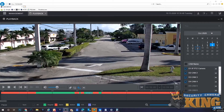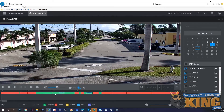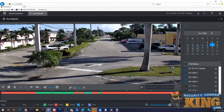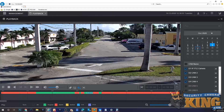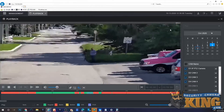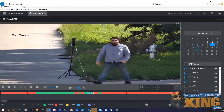Before we show you the footage, just take a look at the bottom of the screen and notice that there are two types of footage. The green is for 24/7 recording, and the red is for alarm input footage from the camera being triggered by the infrared beams. We've got these beams placed pretty far apart. You can vaguely see me at the far end just standing to the left of the sending beam, and the receiver is past the camera so it's not even in view. You'll see that as the beam is broken, it causes the footage to be recorded, notated, and triggers the PTZ zoom preset on this camera. You can see it zoomed in really far. We have these beams about 100 meters apart, and they work great.